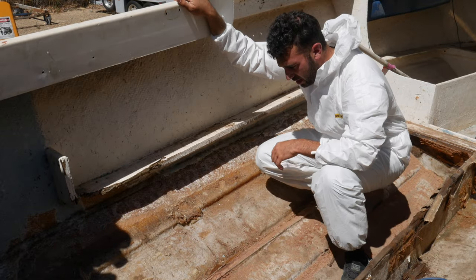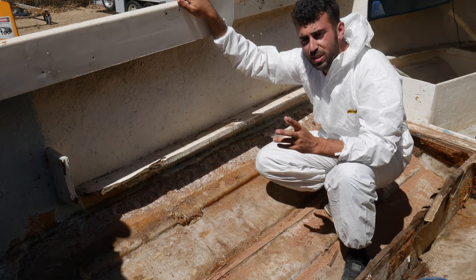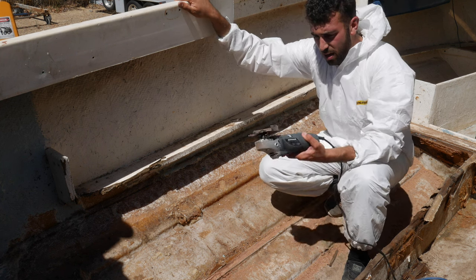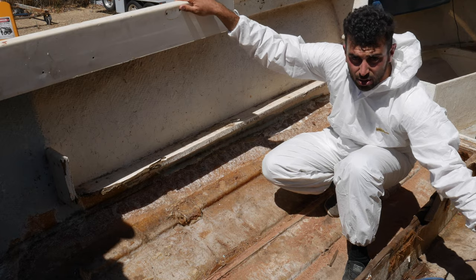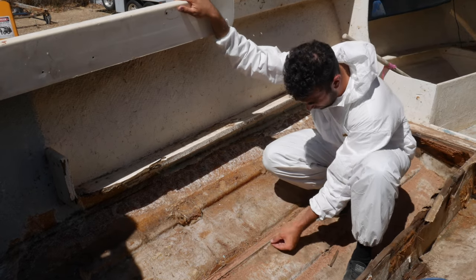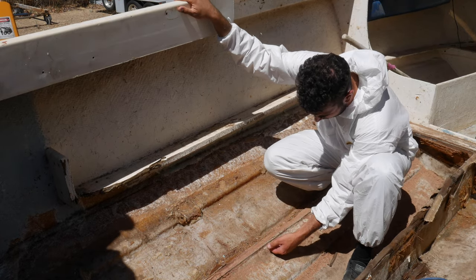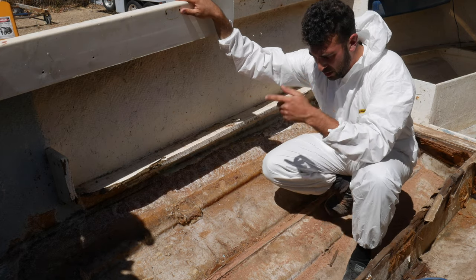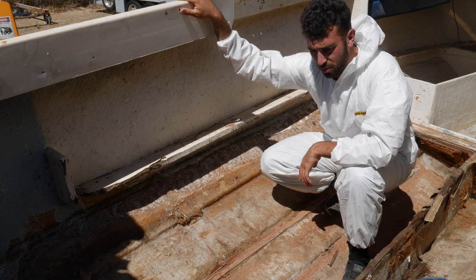So, for the first stringer I tried the reciprocating saw and the multi-tool — it was going to take a long time. I ended up using this grinder with the multi-cutter and that thing just plowed through. I stayed about 10 to 15mm above the top of the hull. Let's get this middle one through, get the starboard side one gone, and then we can work around where the engine bay was for the inboard.